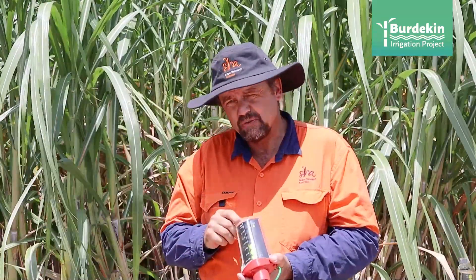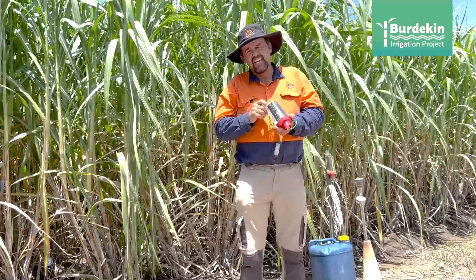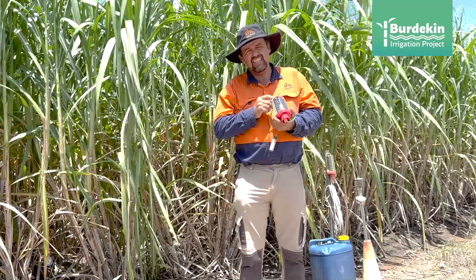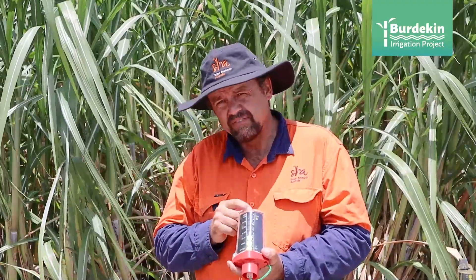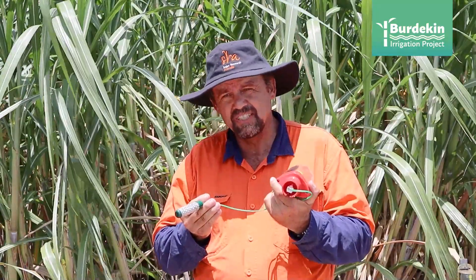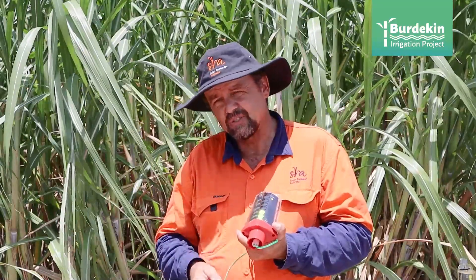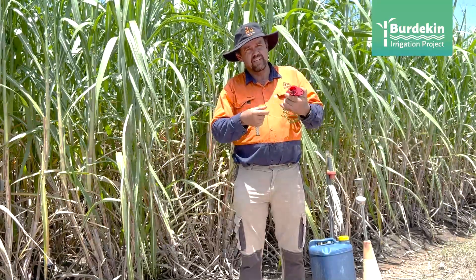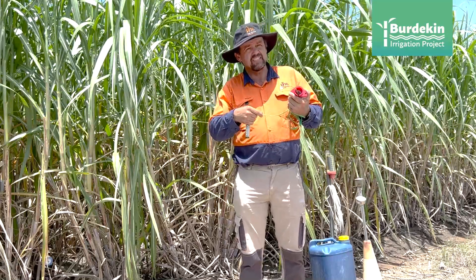Also, since the tensiometer works on a vacuum and a bit of water seeps out over time, you have to refill it every couple of weeks — that's a bit more ongoing maintenance. The G-DOT is battery operated; the battery lasts years. I've had G-DOTs on my farm for three or four years now and only ever replaced one battery so far. What happens though is the cable is a bit of a weak spot when you work around, so you have to retrieve it or put it underground, and the gypsum block eventually dissolves and needs to be replaced. The cable is plugged in so you can exchange just that unit — you don't have to throw it away. The cable can also be elongated so you can plug another length in and go 20–30 meters in if you want to.